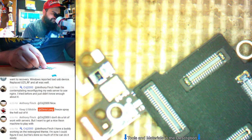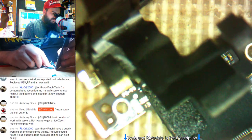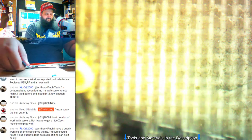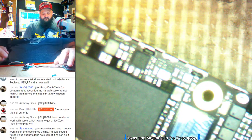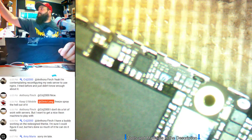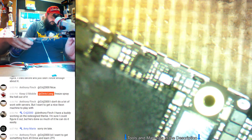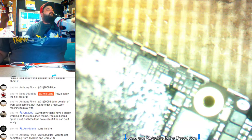Alright, let's hook up the screen. Connectors look good. Yep. Image, no backlight. Okay. So, did you short out the backlight and burn up a filter or fuse? Hold on. I think I got the battery. Yeah, the battery's undone. I undid the battery each time. And you're 100% positive the backlight lines were covered up? I got a piece of tape over it. It has tape over it, but once it's exposed, it's not seen it.